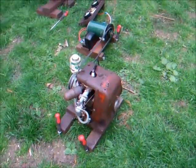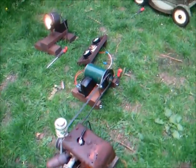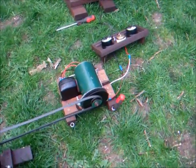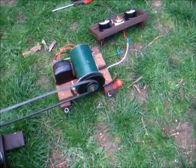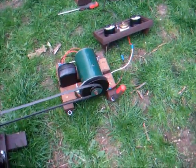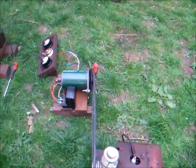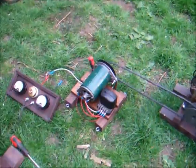Even off of a small engine — it hasn't got to be going that quick. The only thing I have done on this Dynamo is swap the pulley for a smaller one. On these old Lucas Dynamos you can take the pulley off but keep the fan on, and then you can just switch any pulleys. This is the two halves of the pulley from the inside of a self-propelled mechanism for a proper lawnmower — just had to enlarge the holes. It gives a bit more speed on the Dynamo so the engine can run a little bit slower.